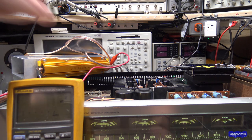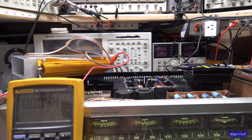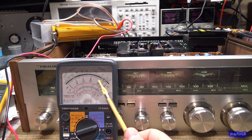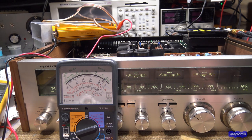We're good. And this resistor is ice cold because this is a 300 watt resistor and I'm only putting 10 watts into it, so it could sit there all day and it won't hurt it. The meters are set. That's all there is to it. You just adjust it to be the wattage that it's supposed to be. And you can see we're on the 10 volt scale using just an analog meter. And there's 8 volts. This dash right here is 9. We're just before it, and it's right on. Same thing. So you could use either the analog or the digital and it will work.